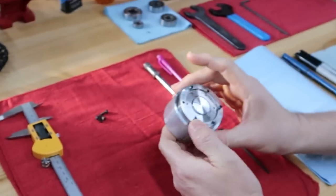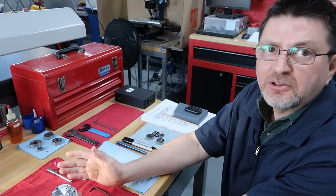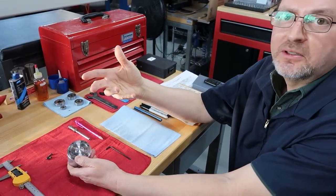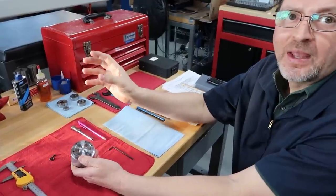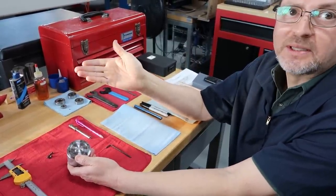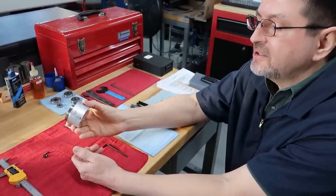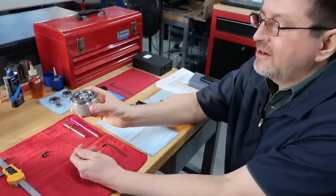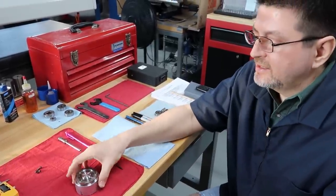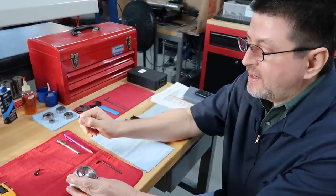It serves the modification of your bearing cap, but also in the future, at any time, you don't have to rebuild your spindle just to remove the bearing cap and do a light surface cut on it to clean it up for cosmetic purposes. You can do that any time. So the fixture, yeah, it's a pain to make, but you can use it anytime. That's pretty nice.